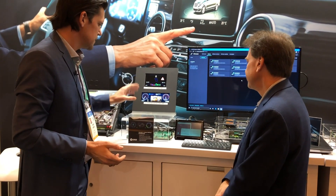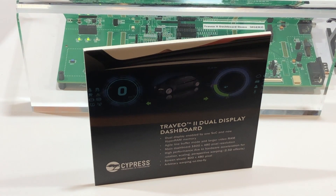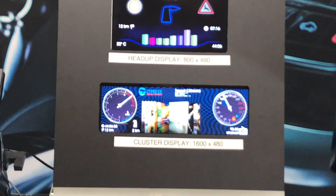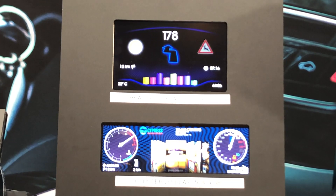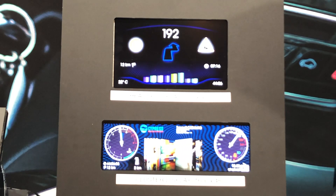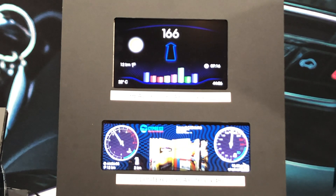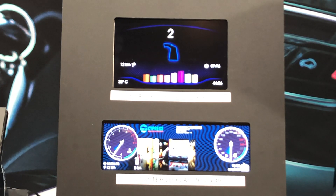What we see here is a first sample of our Traveo 2 graphic devices. These are powered by the same device at the same time — not two separate devices. And only based on the internal memory footprint: there's no external video RAM needed. It's a single processor powering these two displays, and it only uses 60% of its available video RAM — about two and a half megabytes out of four megabytes — to drive those two displays.